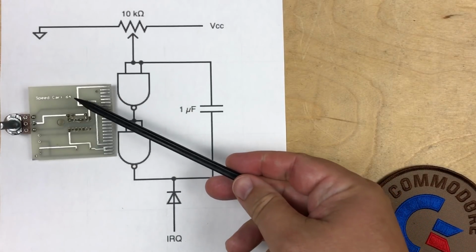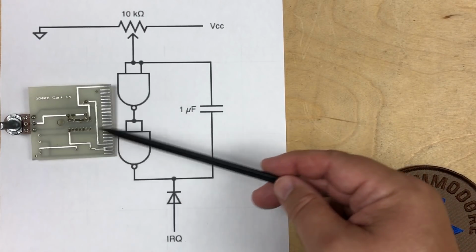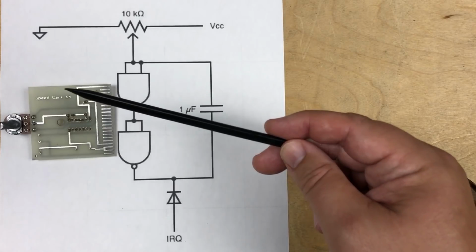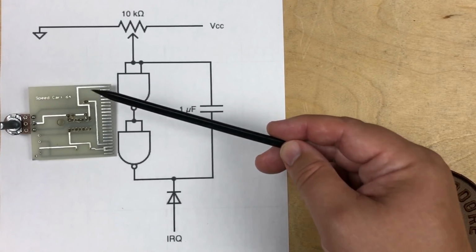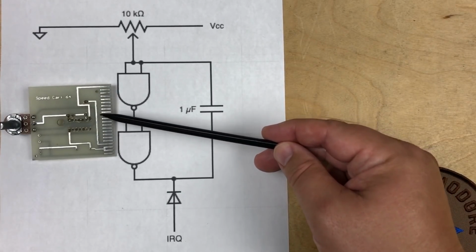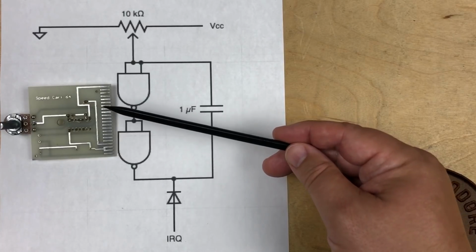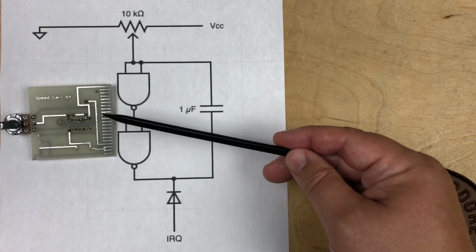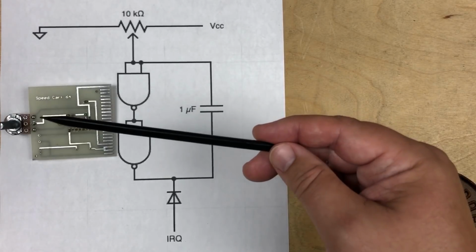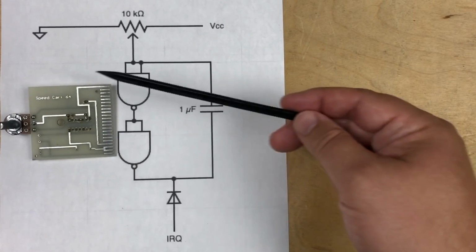In case it wasn't clear, SpeedCart 64 does not affect the Commodore 64's system bus speed or clock speed at all. The computer continues to run at the same 1 megahertz, give or take, that it always does. This cartridge just fires off spurious extra interrupts that may or may not cause the computer to become so busy that it can't do its regular tasks as quick as it should, or in some cases at all.